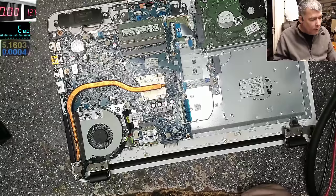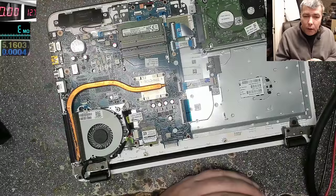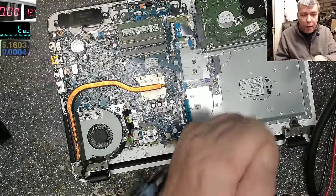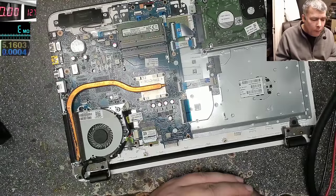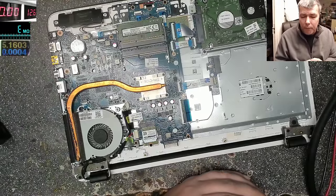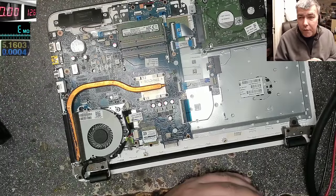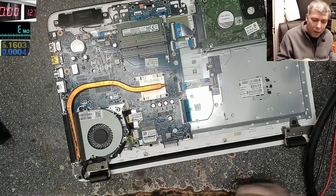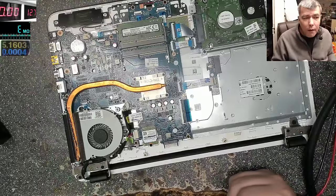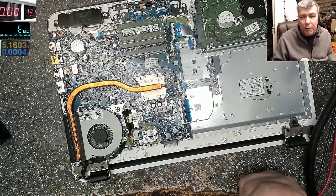It's like in your home, it's your main power rail, your mains, and you plug everything there, same in the laptop. It's no difference. Now it's very hard with the multimeter. So somehow you have a partial short there. 5 ohms is not very low. Low is if you have like 0.1 ohms. But still, you can't really find the fault with a multimeter, especially a fault like this.